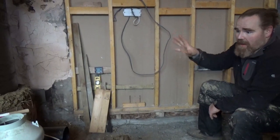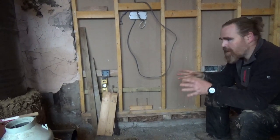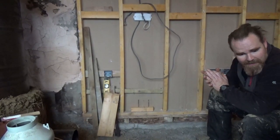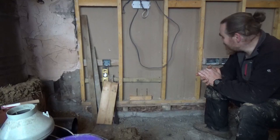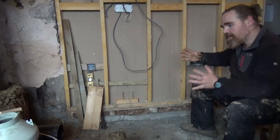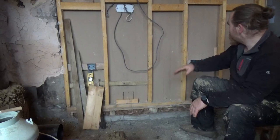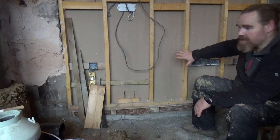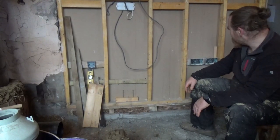With the core completed and the barrel in place, that's all pretty much ready to run other than cobbing around it. But the next stage is to do the cob bench — the mass bench. Unfortunately this is going to have to be done in a few different stages, because behind this wall is the bathroom and I want to get some of the heat into the bathroom, because it's always a really cool room. It's nice having a warm bathroom. So what I'm going to do is cut a big hole in this wall and expose the bench into the bathroom, but being a really old, complicated house it's not going to be quite that simple.